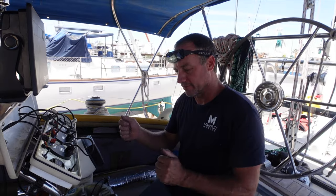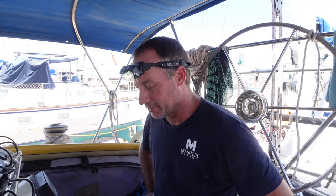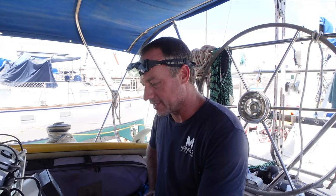I do have the cables — I put them on the boat just in case we did break a cable. So that's the forward and reverse cables and the acceleration cables. I do have two of those and a rebuild kit, but I don't have the cable and chain. I'm wondering how far to dig into this. Obviously we want to get back in the water, but this is something a lot of people overlook. Your chain and wire could be like your rigging — every 10 years you'd want to service it if you want a trouble-free run.